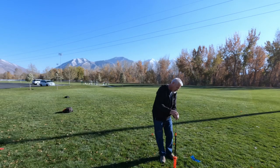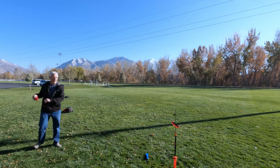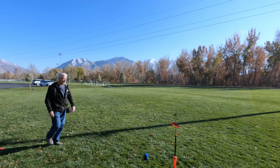All right, a couple of notes here, a couple of tips for doing something like this if you've never put up a dipole antenna, like a portable operation on a SOTA activation or even POTA. If you get your ends out first, it's going to keep them from tangling at the base of the mast as you're raising everything up.